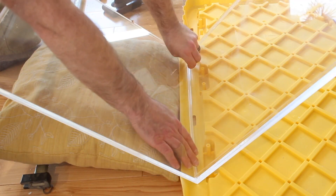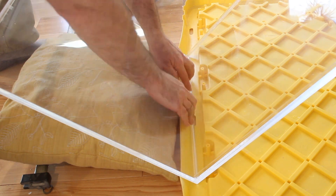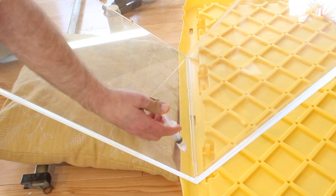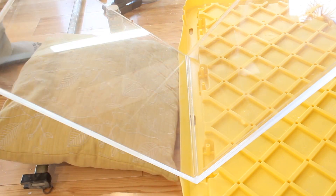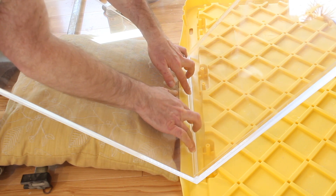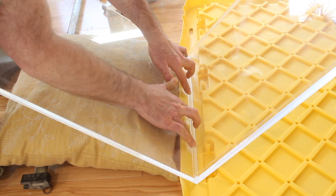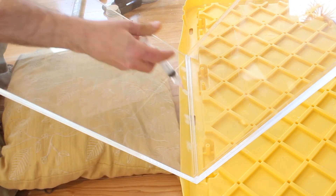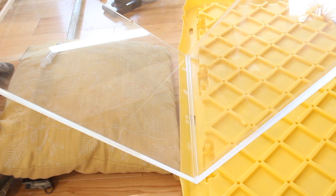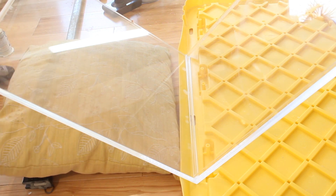The final step I do when these sumps are all done is I put into every single seam a piece of quarter-inch acrylic, which is basically reinforcing and sealing every single seam. This is an extra step that you don't have to do — it's probably a crutch because if your seams are good enough, you don't need to do this. But I feel better doing this on every single seam. It strengthens the seam and makes sure that they're absolutely watertight.